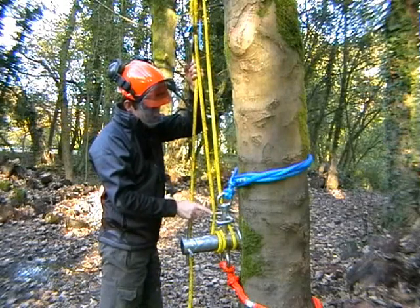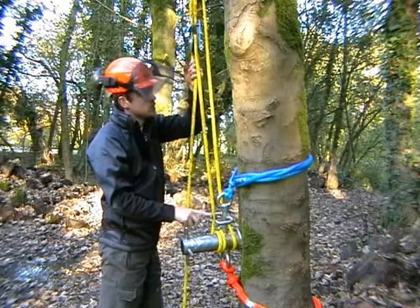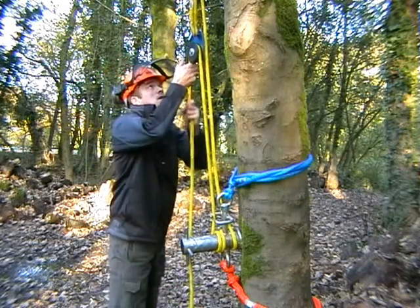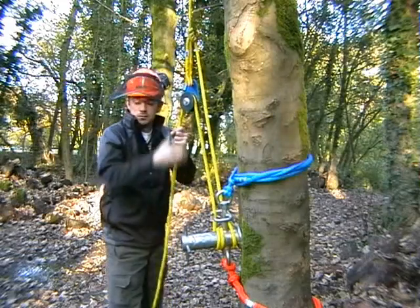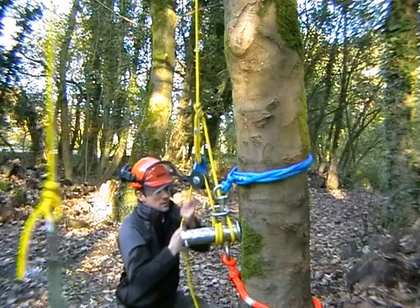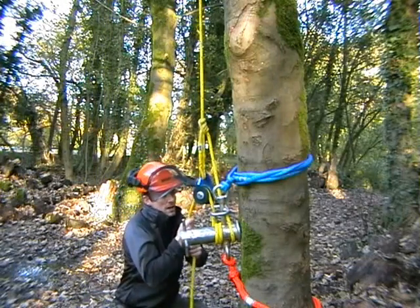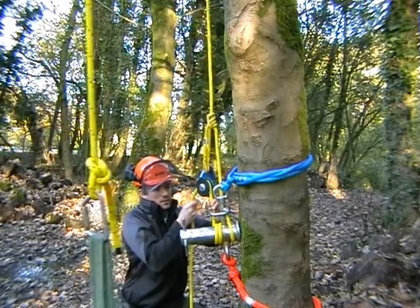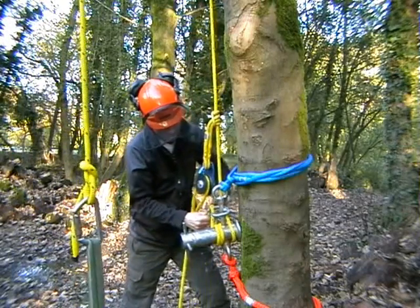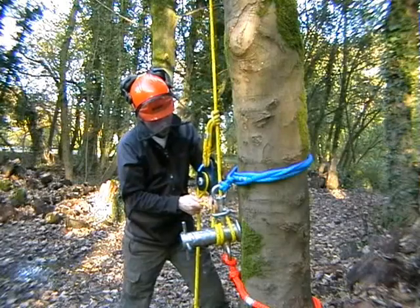Now the rope is kept in position by this guide hook, so it's important that we keep the rope behind the guide hook. From there onwards we apply our tension, and when you run out of line you just pinch the rope against the guide hook and put a turn on it for security.